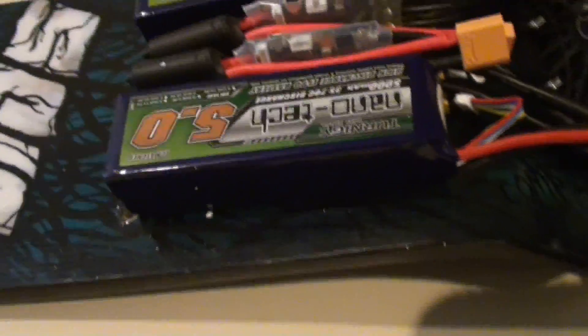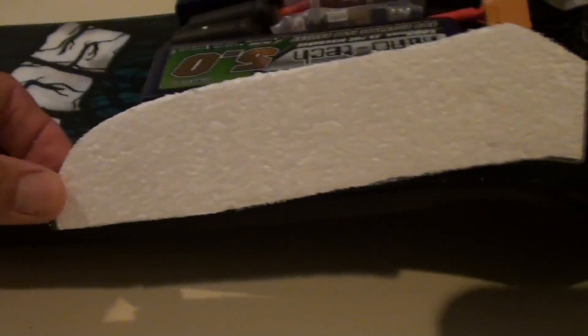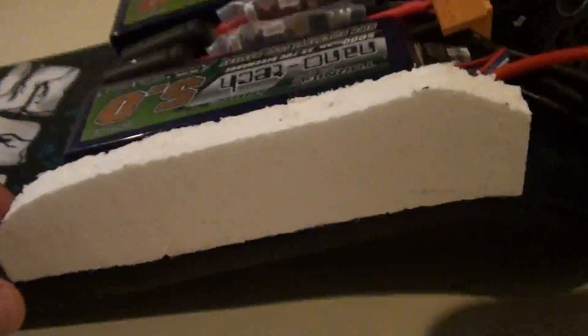I decided to make my own enclosure — it's where the batteries and the VESC are going to be mounted, along with all the wires, at the end of the board. I cut out this piece from a piece of styrofoam to make a mold. It's pretty simple. The board has a little contour to it, so I shaped the mold to fit. I glued up the styrofoam together — if you can find a thick piece it would probably work better, but this is all I had. It doesn't have to be pretty or exact. I'm going to cut it down, sand it, and cover it with some tape, so as long as it's close.